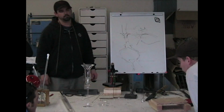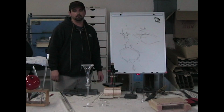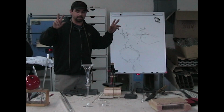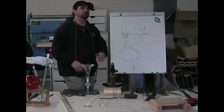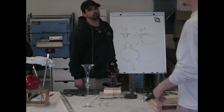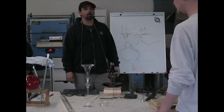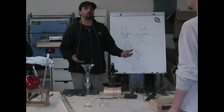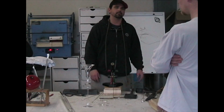What do you normally recommend, since a piece like this is delicate as it is? Well, I bring it up to what's supposed to be 1050, but I take it up to 1025, and that's still too hot on some pieces that have a lot of weight, and hold it there for 5 minutes, and then bring it down to 700 over 3 hours. You reach a piece for just a second, then lower it some. Yeah, for 5 minutes. Because I know at 1025, I'm still above annealing temperature, so I'm probably in the annealing zone for 5 to 10 minutes.